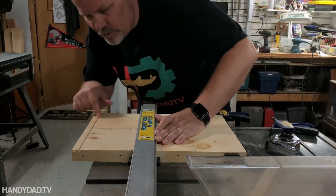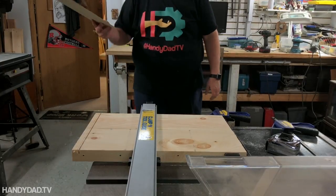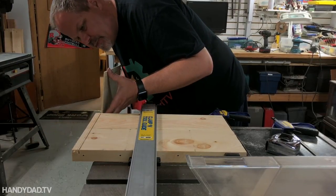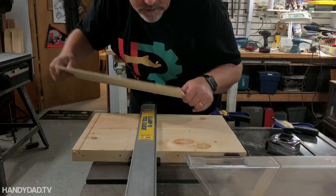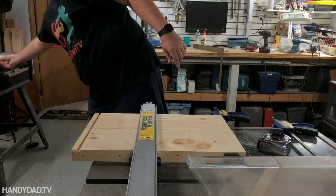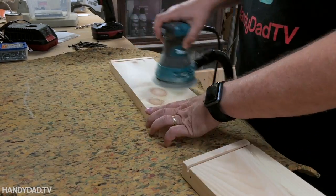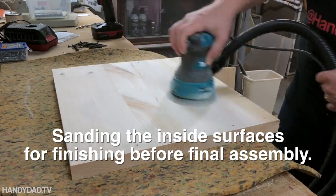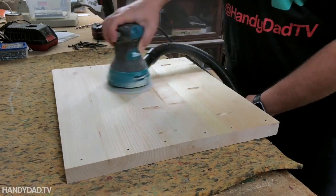What I'm doing now is cutting a groove in the side pieces that is going to hold a back panel. I have a thin piece of plywood, and I'm just running my saw through at about three-eighths of an inch deep — a couple of passes to make it wide enough to hold the plywood. Just on the sides, it'll hold this piece of plywood on both sides.